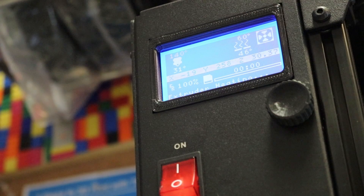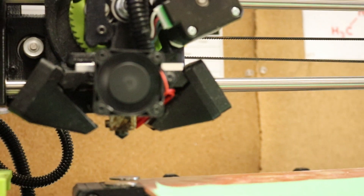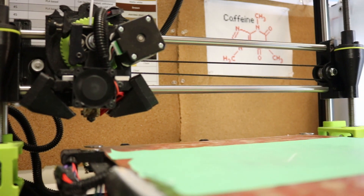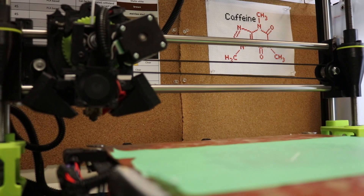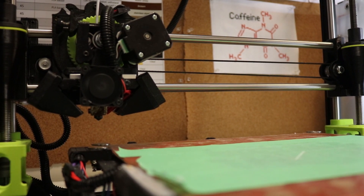We're starting now. The 3D printer is going to go through a cleaning stage. It'll first wipe off the nozzle of any PLA leftover from the last run. Then it's going to go through an auto-leveling process to make sure the platform is totally level in case you bumped it. After it's gone through that auto-leveling process, it'll back up and then start printing.